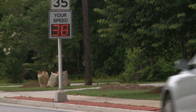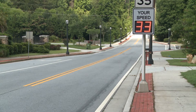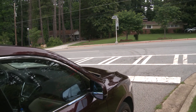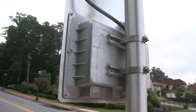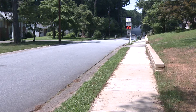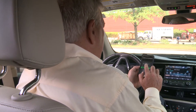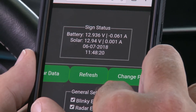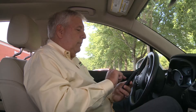For your convenience, the TC600 uses a Wi-Fi transmitter to operate the sign, change settings, and download traffic data. Wi-Fi is an improvement over the older Bluetooth method — it provides ten times the range and you can communicate with a sign up to 300 feet away. It has a much faster transmission rate and eliminates the COM ports and pairing complexities of Bluetooth. Wi-Fi also eliminates the issue of device compatibility. All you need is any smartphone, tablet, or laptop that offers Wi-Fi access through a web browser such as Safari, Internet Explorer, or Chrome. There is no connection to the internet required whatsoever.